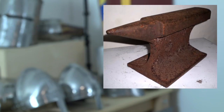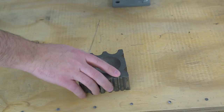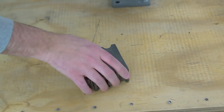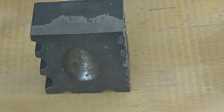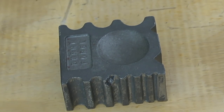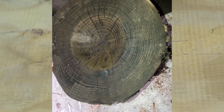If you can get a railroad rail, those work well. A lot of people have fashioned those into decent anvils because it's going to be very high quality steel. But I'd say if you can get any piece of metal, get it and see what you can do with it. You could start with something like this — this is a swage block, made out of cast iron. It doesn't have a hardened surface like an anvil would, but for a starting piece of metal it might work for you. You can also use a stump or a large piece of wood, and those are very useful for making different shapes.